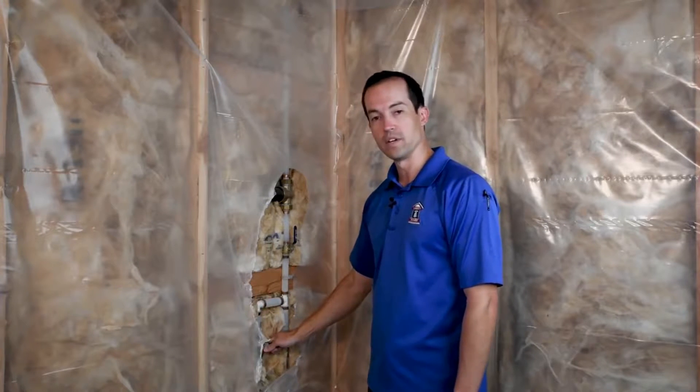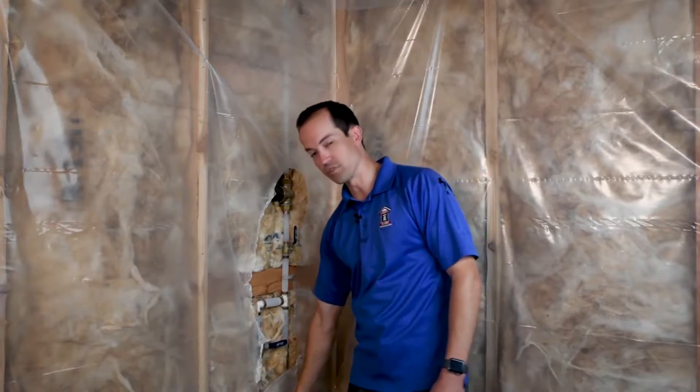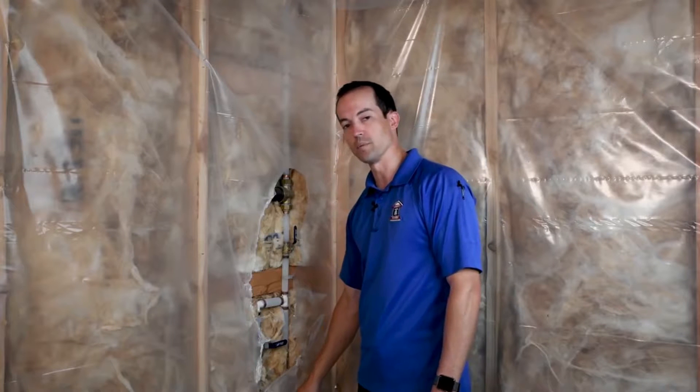So the first thing you're going to do is shut off the valve here. Down below here is the drain valve, but don't drain it until you're able to go outside and open your backflow preventer. Let's head outside and I'll show you that valve. After you've shut off the valve in your basement to the sprinkler system, don't drain it yet.